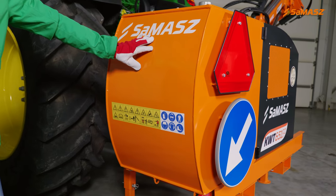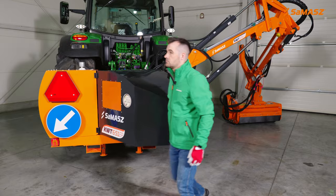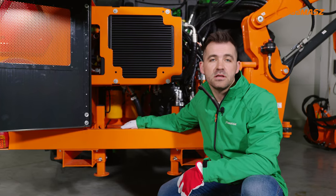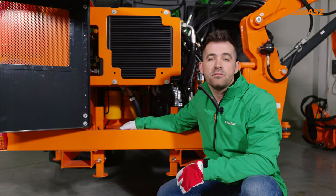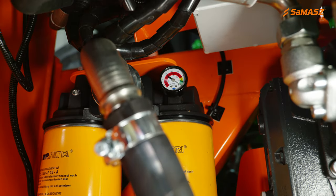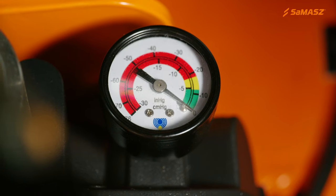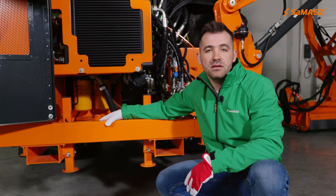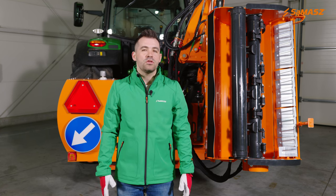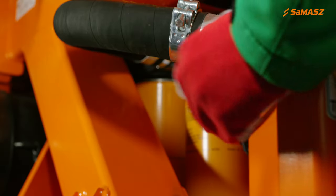This oil tank is equipped with temperature and oil level sensors. The hydraulic oil is continuously filtered by means of a built-in filtering system. The oil filters have a contamination level indicator. The oil must meet the required cleanliness class standard that can be found in the operator's manual. If it doesn't meet the required cleanliness class, it must be replaced. Before starting the machine, you need to open the shut-off valve, which is located on the hydraulic feed line next to the oil tank.